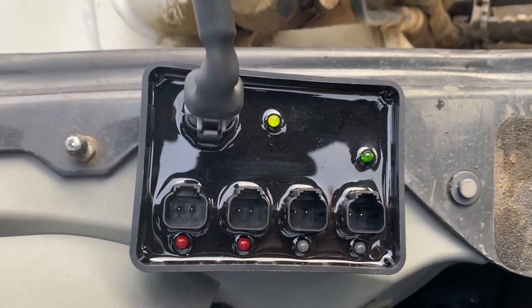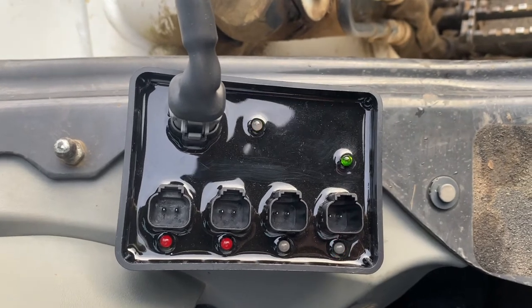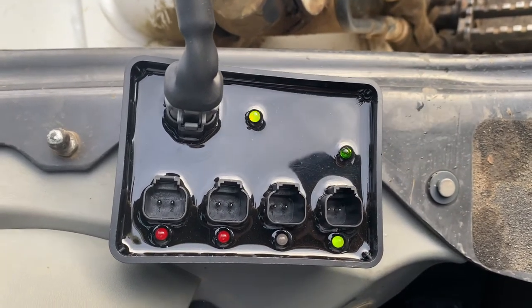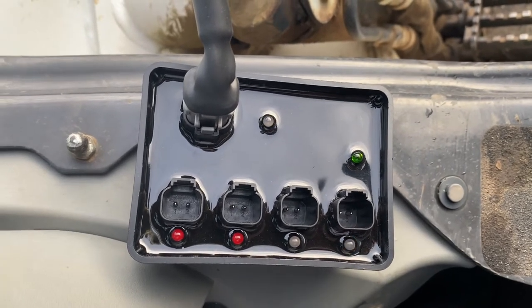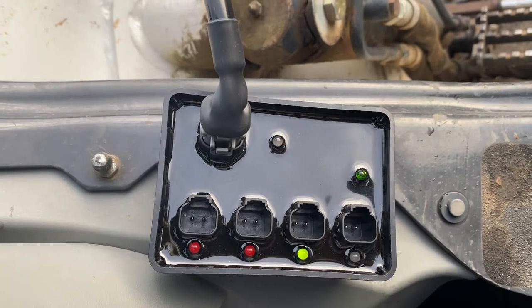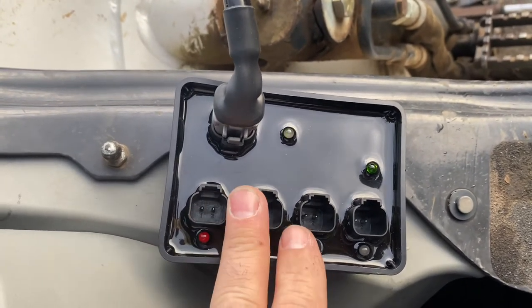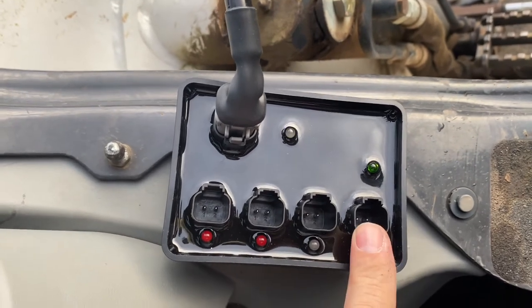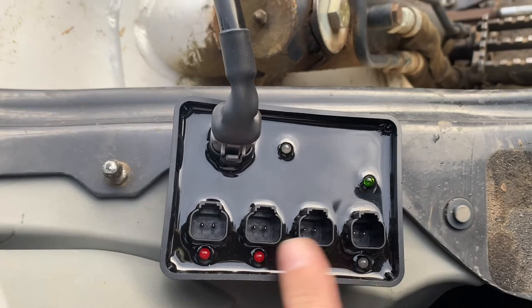So now watch. I'm going to do the same buttons again. B1, B2. See how it's gone to that first port? And it's changing the polarity, so I'm getting the different colors here. Now I'm going to go C1, C2. Here's C1, here's C2. So these other two ports right here, they no longer work, they're dead. These are the ports that are active, and they're giving you plus 12, negative 12, plus 12, negative 12. So that's two sets of channels.